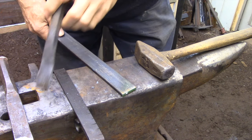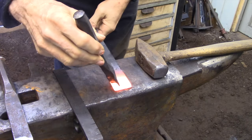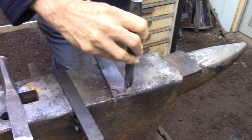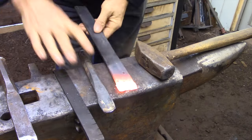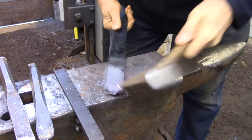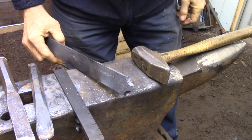If you don't feel confident about forge welding the handle to the blade, don't worry about it. You can just forge the handle with a flat spot and rivet the two pieces together. But the process of forging out the blade remains the same. Also, I'm using a curved chisel because I have it and it does make a nicer transition into that scarf, but if you just want to use a straight chisel and cut two 45s on each side of the bar it wouldn't really affect the process that much.